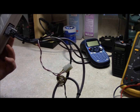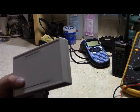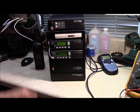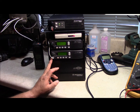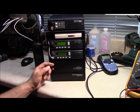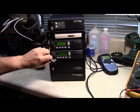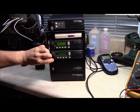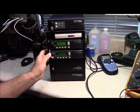I'm going to use the same cable. I mounted the controller temporarily in here and tied it into the transmitter. I've decided to keep the microphone jack interface for the transmitter rather than running it into the bottom connector. The nice thing about this is I can just unplug this and take the transmitter offline, remote a microphone from the site, and use the transmitter. I can also use the transmitter as a base radio — there's a lot of different things I can do by just maintaining that right there.